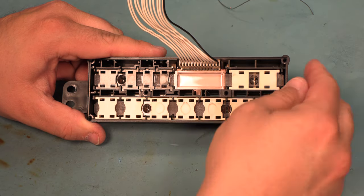The symptom that would cause us to replace these transistors is if the air conditioning compressor request was not turning on, or if the LCD display on the controller unit shows three dashes or blank. That would be a good symptom that we need to replace those transistors. Those transistors are surface mount components. To replace those,